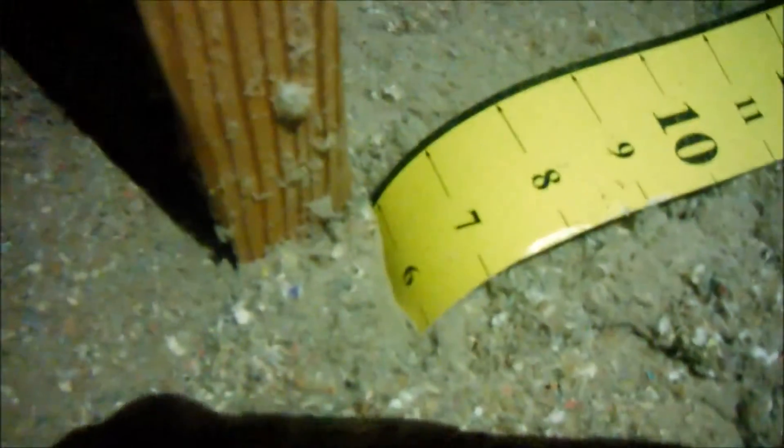If you look, you can see the bare rafter exposed right here and you have what's called cellulose insulation. This is actually a conductor of fire and it is not fire retardant, so it is not recommended to install this type of insulation. Another thing is you only have 6 inches of insulation.